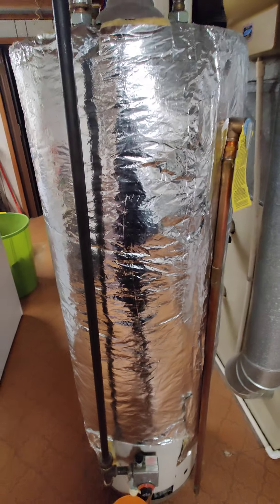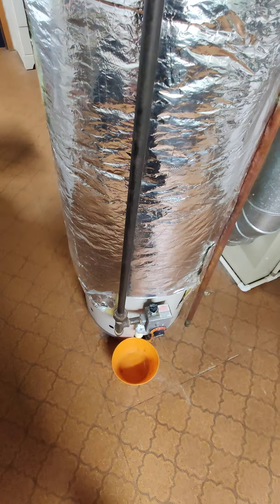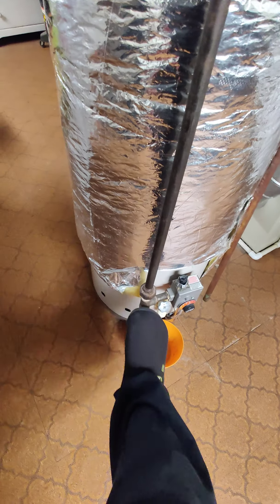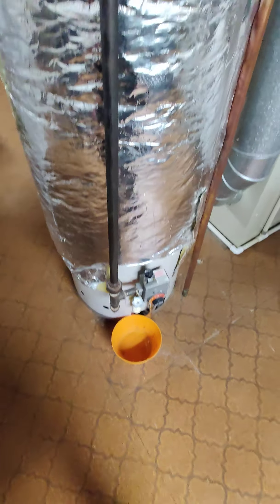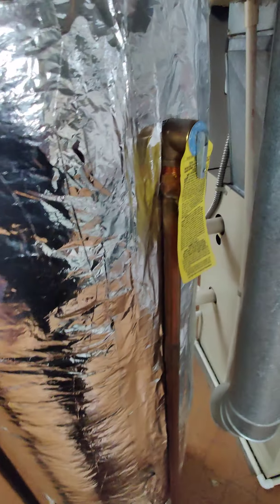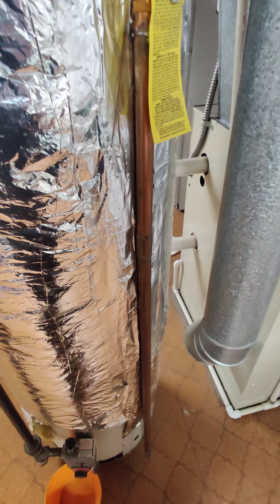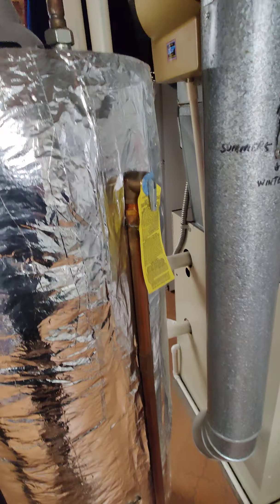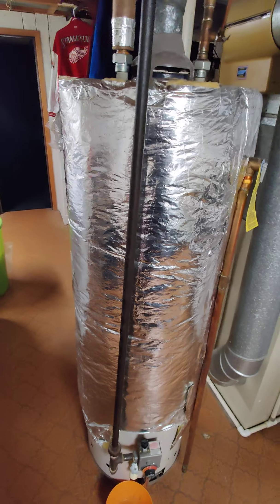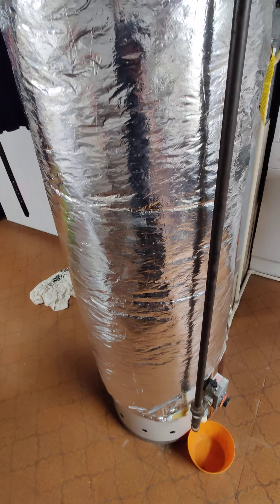It's just galvanized screws. Drain the tank, then take off your union fitting for your gas. Disconnect the fittings from the gas valve in case you need them for the new tank. Disconnect the pressure relief drip leg because you'll want to use that on the new tank as well. That's basically it guys — it's easy to install a new hot water tank. Have a great day, peace out.